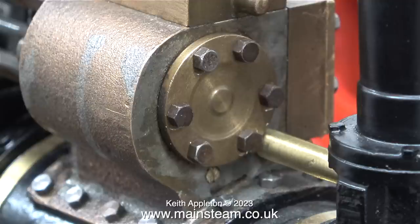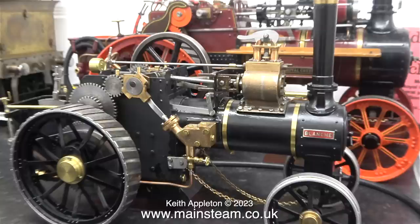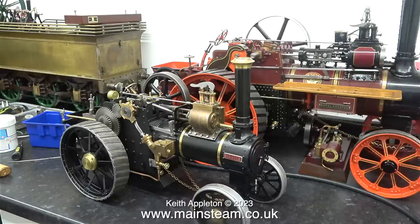That is it for the inspection — I can't take it any further. This thing is diabolical. As an educated guess, the build of this traction engine started quite well — the wheels are good and the gears are good, though you do buy them off the shelf. The cylinder, even though it's scored, is serviceable — nothing a re-lap and an oversized piston wouldn't put right. If the original builder had completed this engine I'm sure it would have been fine, but as a wild guess the original builder did not complete it — I don't know what happened to them.